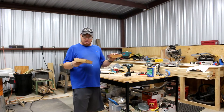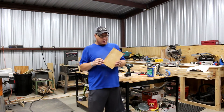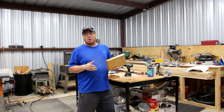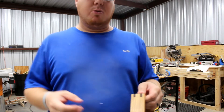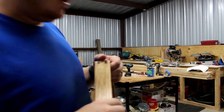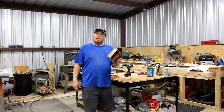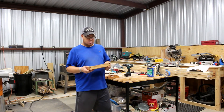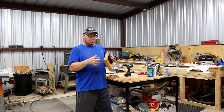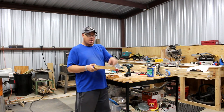These two little guys are finished. Both of them are done and this was a fun little project. I used all scrap wood to make this, and from making this project I can tell you I need to invest in a flat-top saw blade. You can see there's a little bit of a gap there from the saw blade having a slightly rounded point rather than being flat on top — that's something I need to look into. I made a mistake here and to cover it up I put another inlay in there to go with the other theme. It looks a little weird, I'm not real crazy about it, but since this was just a fun scrap wood project I went ahead and threw that in there.